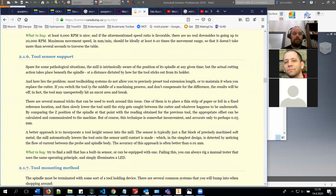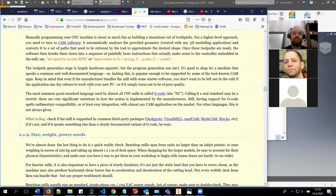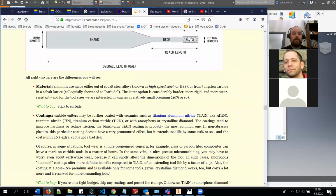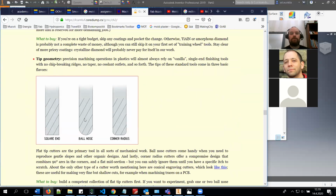In this material, there are quite nice instructions for simple things and how to cut them and what other things are called in the milling bits and what kind of milling bits can be found. For example, if you are doing the rough cut, you should always use the square-ended milling bit. And if you have some curvature on the surfaces, you can use ball-nosed. Typically, these are the two tools that are used for this task.